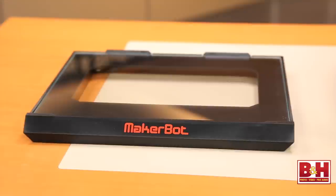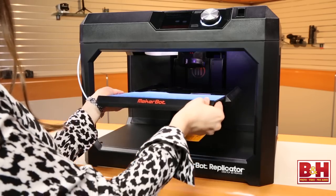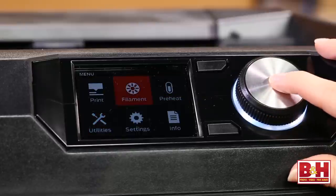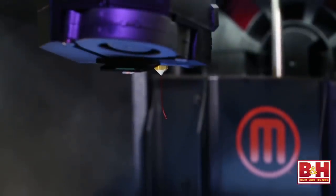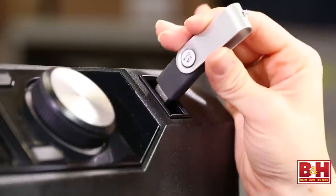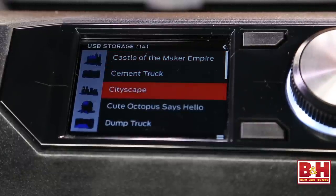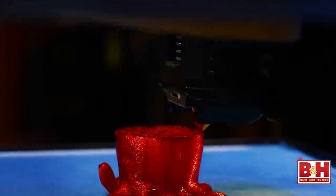So you've got your file ready. To prepare the printer you'll probably want to cover the build plate with painter's tape, which will help you remove your finished print without harming the build surface. Turn the printer on and feed your filament into the extruder — it will take a few minutes to warm up to the temperature needed to melt the filament. Most printers calibrate their machinery automatically but some will require manual alignment by the user. Send your prepared file to the printer via USB, or by inserting a flash drive or SD card directly into the printer. Some models even allow you to send files via Wi-Fi.